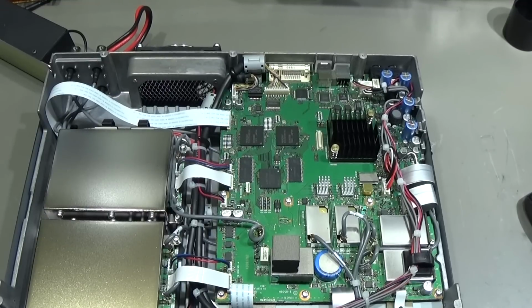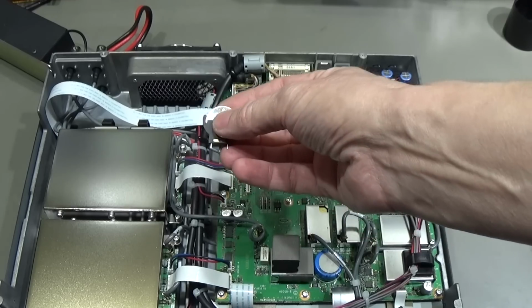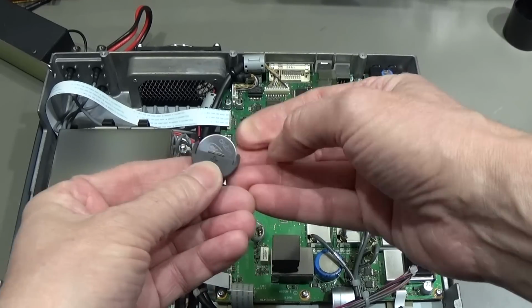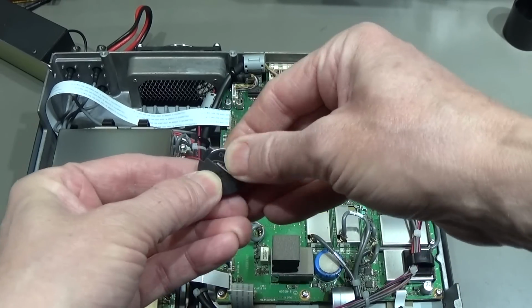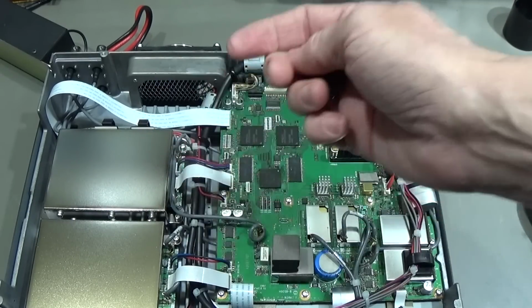Having said that, the question now is, what could be a solution? One solution, and of course there may be more than only one or two solutions, but that could be one approach to get the problem under control. We could put, for instance, a little battery holder somewhere here into the housing, and we take the old battery completely out, and with a holder like this, you can easily replace the battery. And that definitely will help to extend the time until the battery is completely drained.